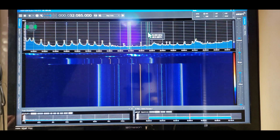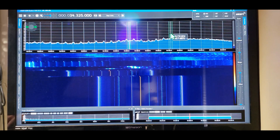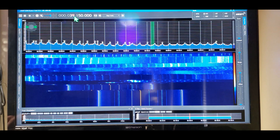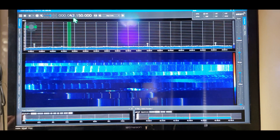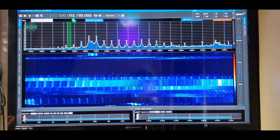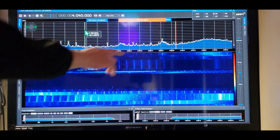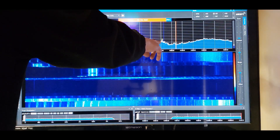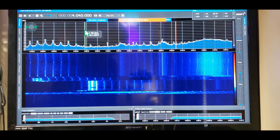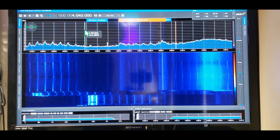Let's see if the capacitor picks up anything further up the band. Scrolling up... around 32 MHz we're kind of getting out of range. So at about 50 MHz you're not going to get much. Looks like we got quite a few bands out of this — 80 meters works. There's some noise that never goes away — probably a neighbor with a plug-in transformer. That's what you deal with in apartments.